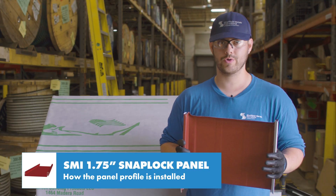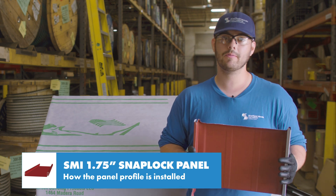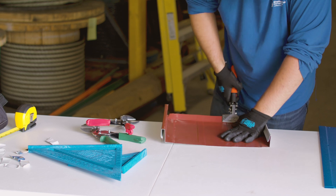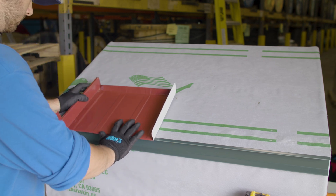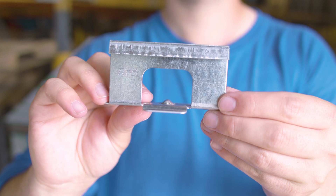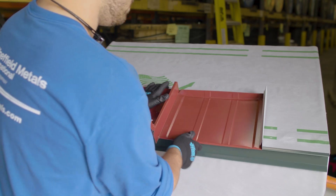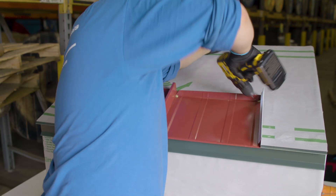Next, let's look at how this goes down on a roof. Make sure to follow the engineering guidelines as to what deck substrate you can install over, proper clip spacing, approved accessories, and other additional requirements. I've already fabricated these panels with a 1-inch bend, but if you want to learn how to do it yourself, there are a couple links in the description. On the deck, the panel hooks onto the eave, is pinned on the box end with a couple fasteners, and uses approved snap lock clips on the male leg. This bead of sealant prevents siphoning of water at the end of the panel. The next panel hooks onto the eave and snaps in place. It gets pinned as well, and the process repeats across the roof.